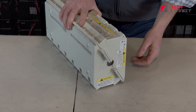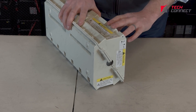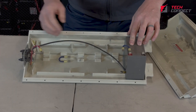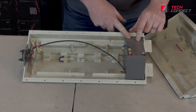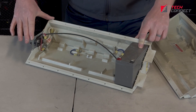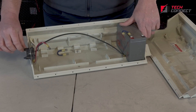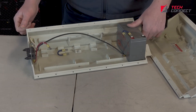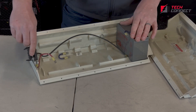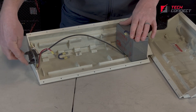The nice thing is they're pretty interchangeable from one unit to another. So if you're a service provider and you have several of these out, you can keep some extra ones and swap them into any 1600 that you have. When you open it up, you'll have six 12-volt 9 amp-hour batteries lined up and connected with jumpers. Back here you have a fuse that can occasionally go out, and then this is your main contactor for the bus bar on the back of the unit. Keep in mind these are plastic, so you just have to be a little bit gentle that they're going in smoothly. Also, if you are doing a battery change, these contactors can rotate — they're not fixed — so make sure it stays in the same orientation or your pins right here will be backwards.